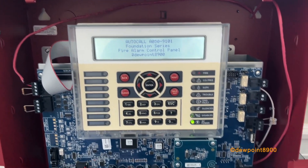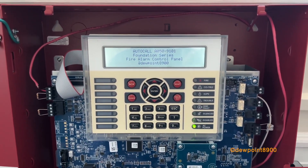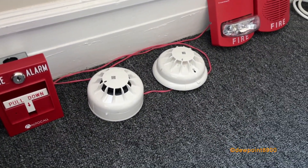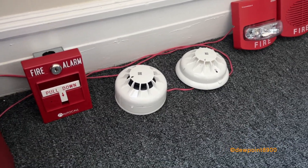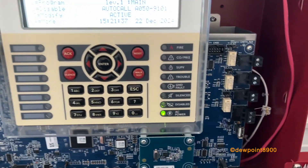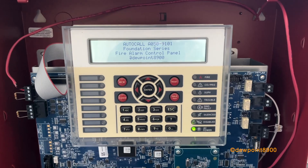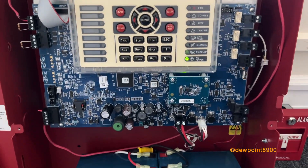I've had some friends run into a few bugs with the NFC and some other stuff in this panel. This panel is a little bit buggy, but I do kind of expect that with a panel of this age — it's still pretty new on the market. The main bug I've run into is that if you change any point type or description on detectors, their magnet test stops working for some reason. I've also had a friend whose trouble LED was on but the system was reading normal, which was a bit weird. The panel is also a little bit slow, though some comparable panels like the Firelight ES50X aren't much better, so it really isn't that much of a nitpick.